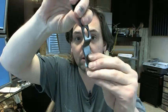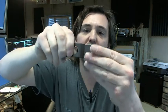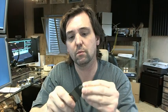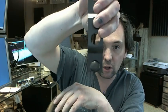You'll sneak this washer to the inside of the opening underneath the lock body and get it started on there. It's intended to look just like that — it's a very tight fit, probably just the thickness of the paint on this exact unit. You'll have to kind of push it down, but there it goes. From the inside you can't get to that because it's inside the lock cavity, and you tighten it down with a very small crescent wrench.